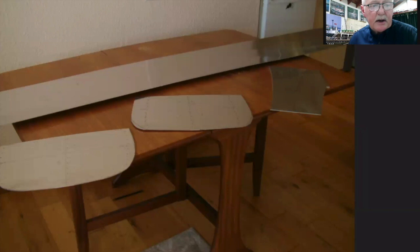I bought a roller bender online, built a stocks with 6 by 2 inch timbers, 3 planks screwed together with legs to the same height as my workbenches and saws, 4 meters long, and marked off the hull stations from bow to stern.